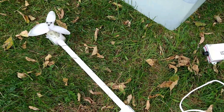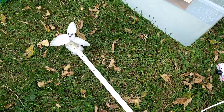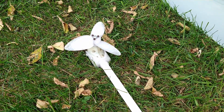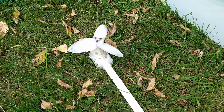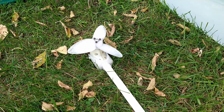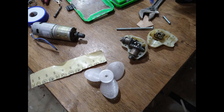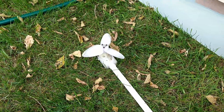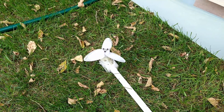There is the 3D-printed prop and the 90-degree drill adapter, which is a 2-to-1 gear reduction. That should give me twice the torque and half the speed at the prop.